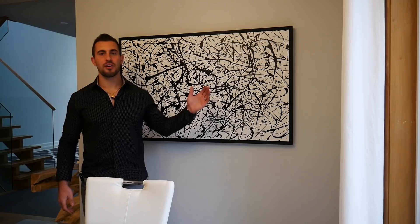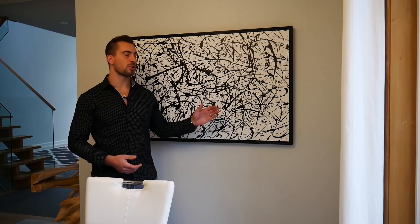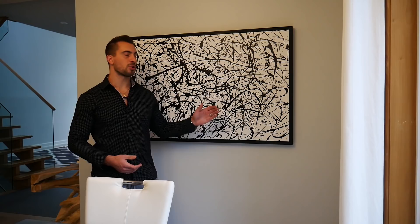Place the brackets in the center of each member rather than in the corners, because the members may have a tendency to bow over time — this ensures we maintain the spacing. Once both frames are attached, it's time to hang it on the wall. I used standard D-hooks. I'd suggest attaching your hanging hardware to the canvas frame rather than the frame you built, since the canvas frame is heavier and more rigid, making it a lot more sturdy and preventing accidents.